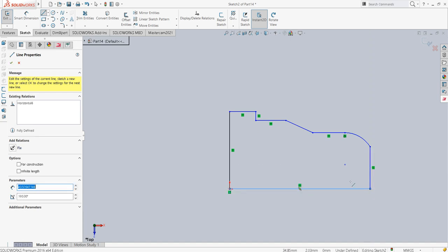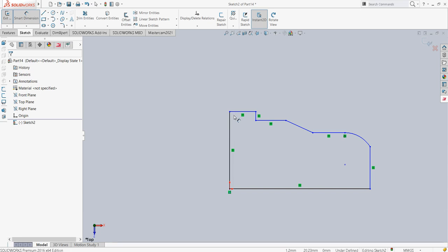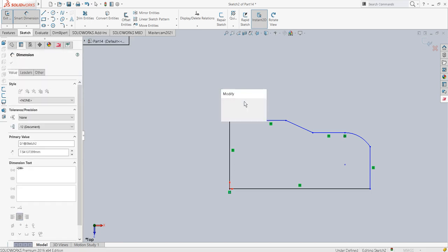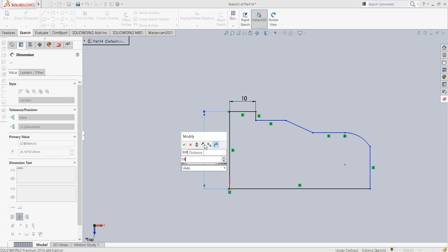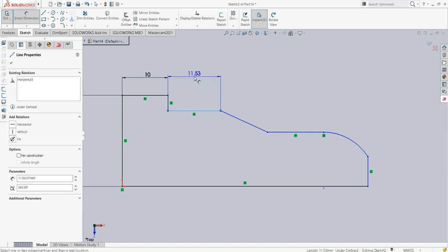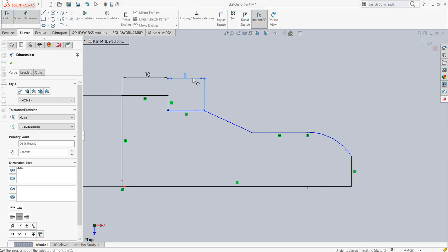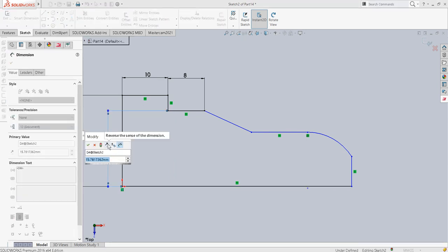This is an end-to-end line diagram of the workpiece. Now I will start giving dimensions. We will assume a reference dimension for the portion held inside the chuck jaw — let's say 10mm. The total diameter is 38, so it has to be taken as 19. The next width is 8, and this diameter — total diameter is 34 — so 34 divided by 2 is 17.